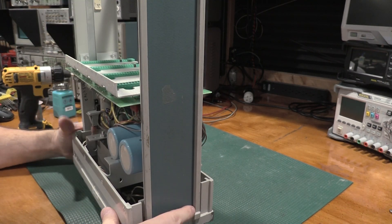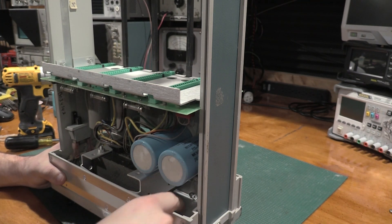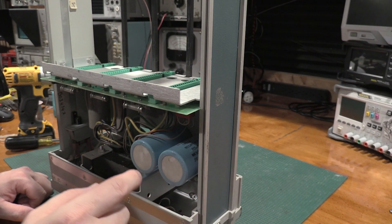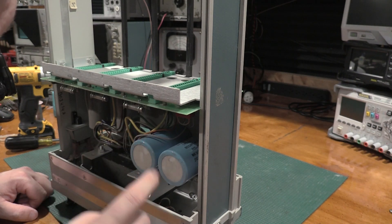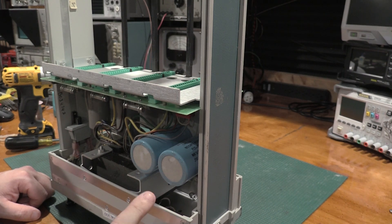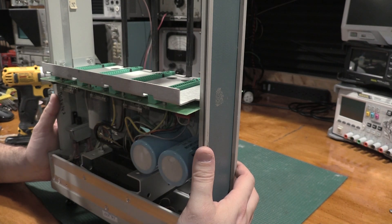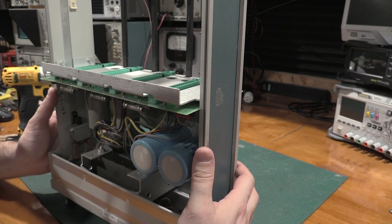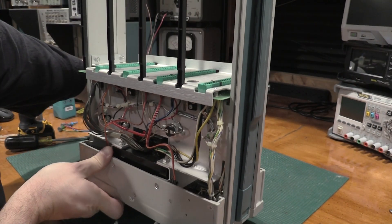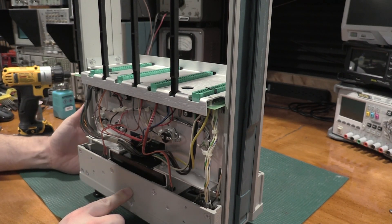The insulator, nut insulator, and socket has fallen in the back. I've got to get the cover back on with the screw through the insulator, the washer, the lock nut, and not short to the chassis. So I have caused myself some pain. Although, let me look — I might be able to get at it. That is well screwed in, but so is that. I might be able to take this lip off.